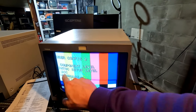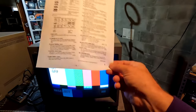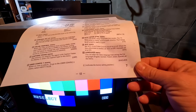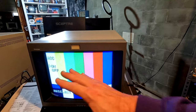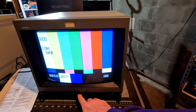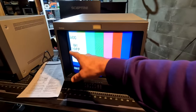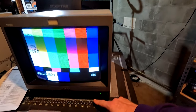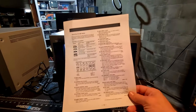Right under that we have ACC — the Automatic Color Control circuit — which we can turn on and off. It says set it to OFF for fine adjustment, and it's normally set to ON. When you get your PVM it should normally be ON. If we turn it off, you'll notice the color dims down some. If you need finer adjustments you can manually turn off the color control and then adjust using the knobs or other presets in the menu.